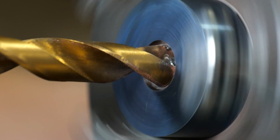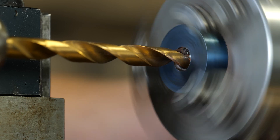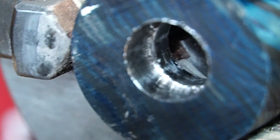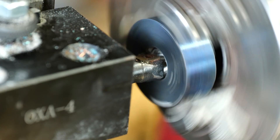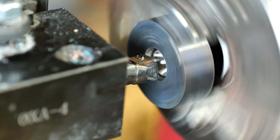Because this is made out of so many different alloys, it behaves differently than what you'd expect and it's just kind of a little bit tricky to work with. You get a bunch of different chatter marks just from the tool jumping back and forth. You get a lot of material hardening going on, so you got to be really careful — make sure that you're using sharp cutting bits and that you're just taking your time and doing it proper.